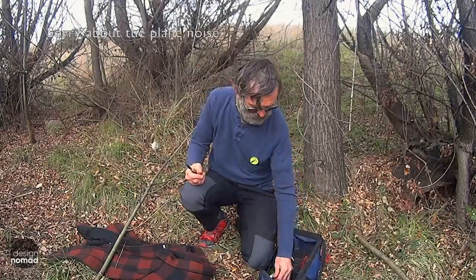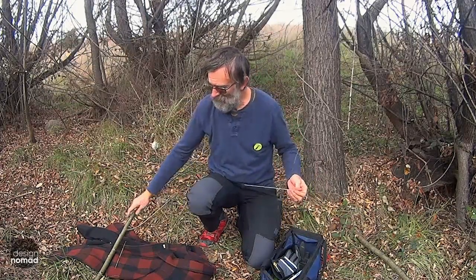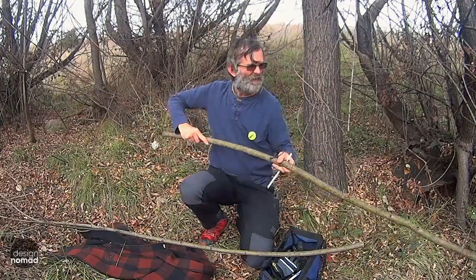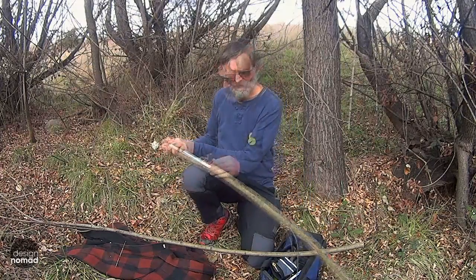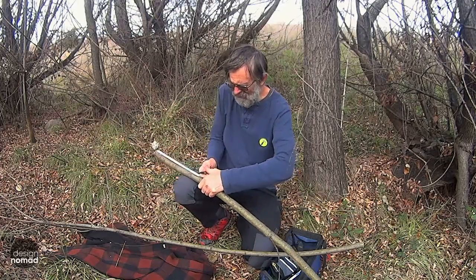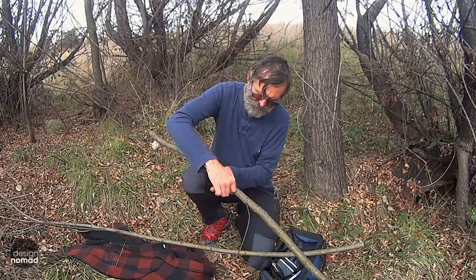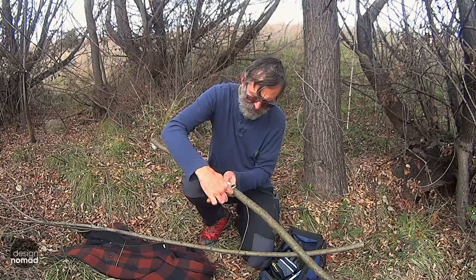We're going to measure up the timber, and the important thing is that everything is based upon the size of your blade. So from this skinnier piece, we're going to take a section out of there, and this one's a bit thicker. We're going to take two sections out of there. So I'm going to place the blade across there, and I'm going to mark that off. Now you could cut this through, saw through it, probably end up doing that. So that's the first cut there, second cut will be there, both these pieces around about the same length of the blade.